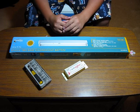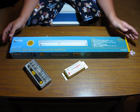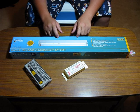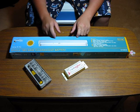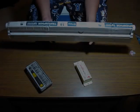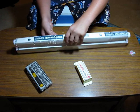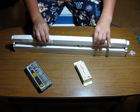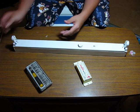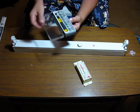The first thing I'm going to have to do before I mount this batten on the ceiling is that it came with a capacitor, ballast, and a starter, and I'm just going to have to gut all that out. Out of the packaging, this is what it looks like, and if I just remove the 18-watt fluorescent light, I can take out the unnecessary components.